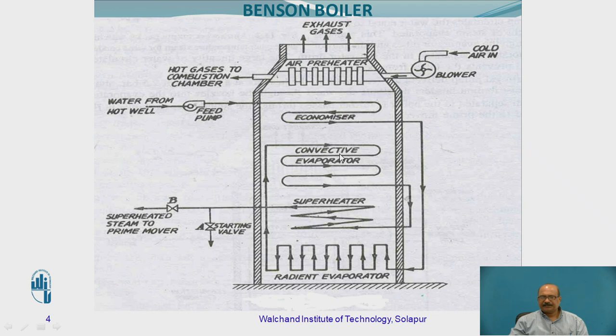It comes to the convective evaporator. Here the final remaining water molecules are going to be removed. Then it passes to the superheated stage — just observe it in the superheated stage, which is just above the radiant evaporator. Here at a higher temperature the flue gases are flowing, so there will not be any water contained in the steam in this particular portion. We are going to be removing all the particles of water so that we get dry superheated steam, which is then sent to the prime mover. The prime mover is coupled particularly for the purpose of production of electrical energy — this is coupled to the turbine.